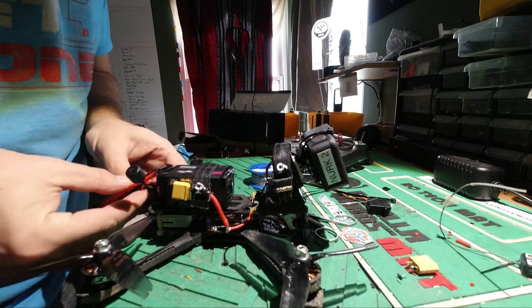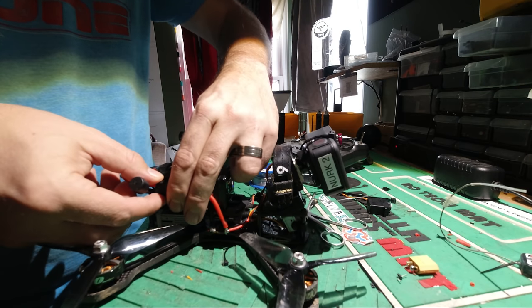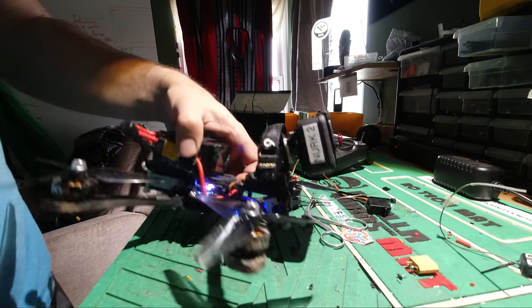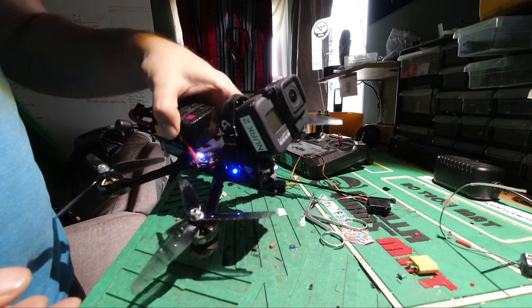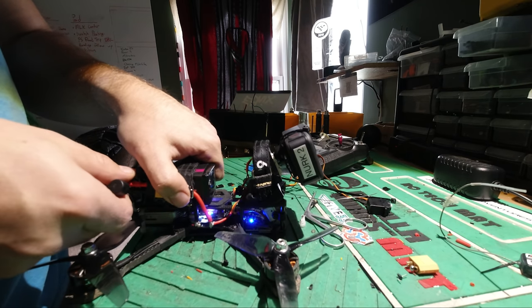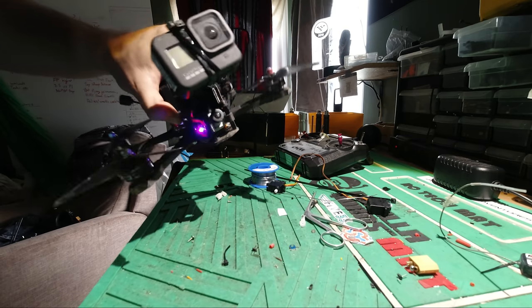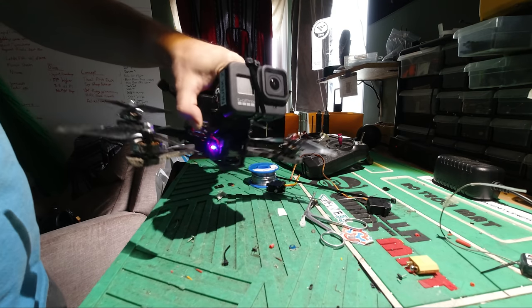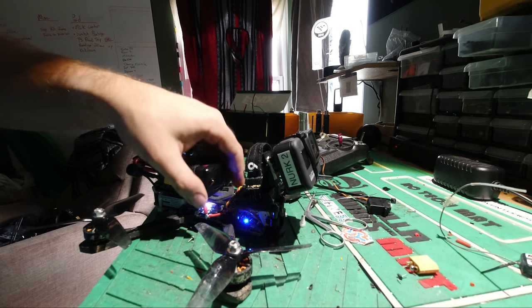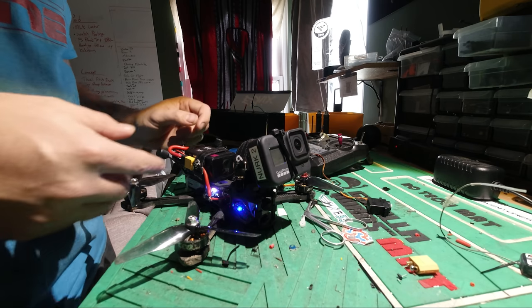Okay, so I've swapped in a much nicer servo, or gimbal servo, from Spektrum. It comes with one of their wing platforms. Hello. Looks like the voltage regulator I gave it is failing every time the servo powers up. So I guess we'll have to figure out a new 5-volt situation.